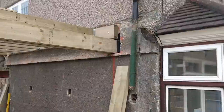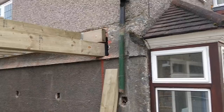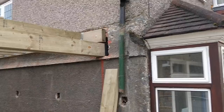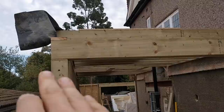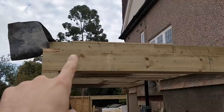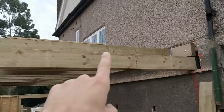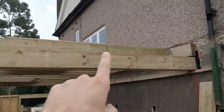As I mentioned, this point here is sitting perfectly on a flat brick and I did not want to cut into the brick. Because of the height of that brick, this was slightly too low on this side. So what I've done is braced it there with an 11mm piece of OSB - he was perfectly happy with that - and he was also very happy for me to then make up the difference on top using two laminations of OSB: 18mm and 11mm, ripped down to the same width as the flitch plate.